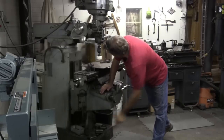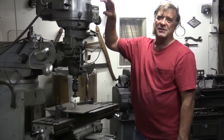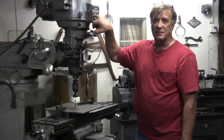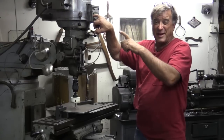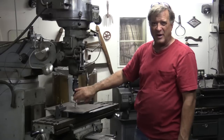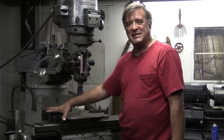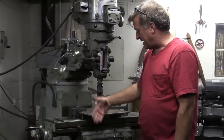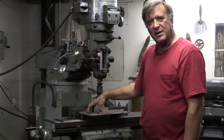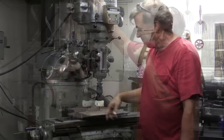You're probably wondering why I'm using the mill, and that's a really good question. The reason I want to use the mill instead of the drill press is because of the low speed — I can turn this all the way down to about 100 RPM, where the slowest my drill press goes is about 1,300 RPM, which is way too fast to drill through thick plate with hole saws. You'll just burn them up, overheat them, lose the sharpness in the teeth. I also like the big table to clamp things to, so I can punch my hole in the center and mark my bolt holes to bolt the piece down when it gets set on the concrete — index those real easy, zip zip zip, all done.